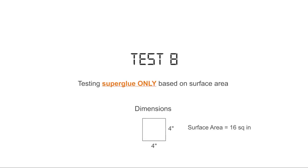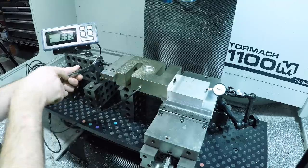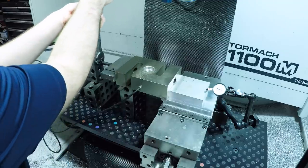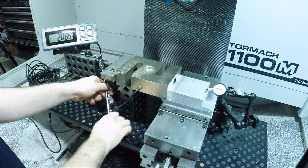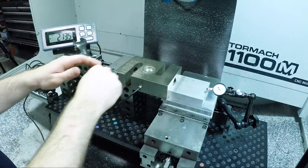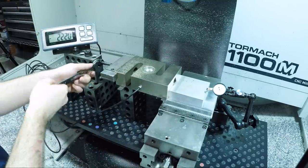Last test: super-gluing a 4-by-4 piece of aluminum directly onto an aluminum fixture with no tape. The tape is great because it makes it easy to separate the part afterward without superglue residue, but as this test shows, the tape is also why we get that creep or flex in the dial indicator. Without the tape layer the part is much more rigid — so rigid that we were actually pushing the whole fixture to the right in the talon jaws, and we called it a day at just over 2200 pounds. Let us know in the comments what you want to see next and what more tests we should try. Hope you learned something — take care, see you soon.